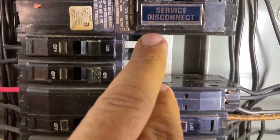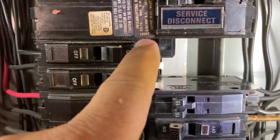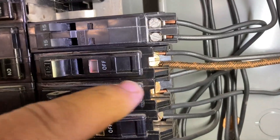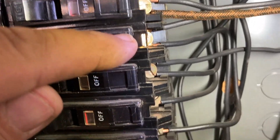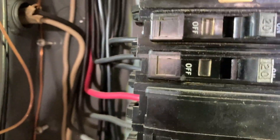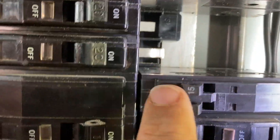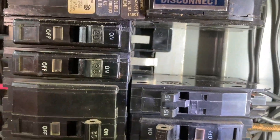I've removed two of these breakers. I took the one up here — it was a 20 amp dedicated for the furnace, which has a switch with a 10 amp fuse in it so it'll never draw 20 amps. I tapped that onto this breaker right here — you can see there are two wires coming off of it now. That basically allowed me to remove three breakers and install the piggyback, so now I've got room for my generator interconnect breaker.